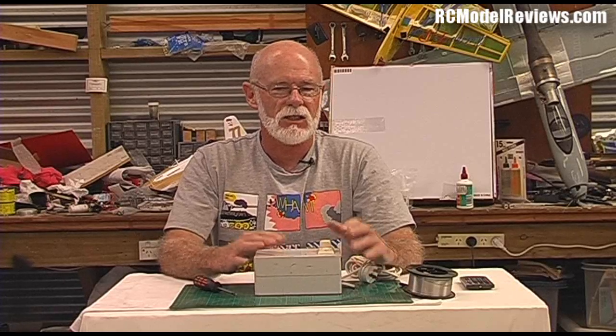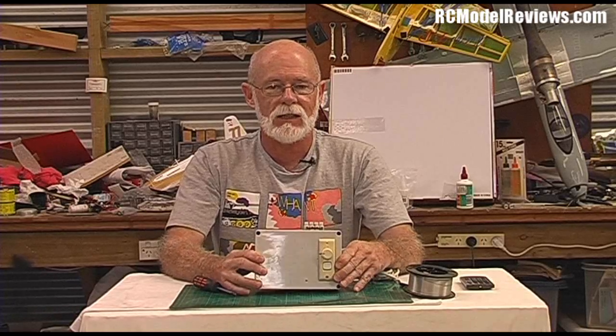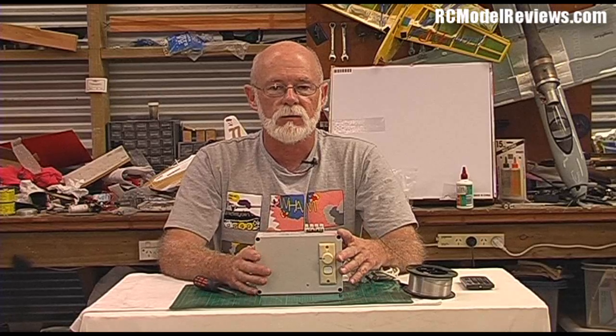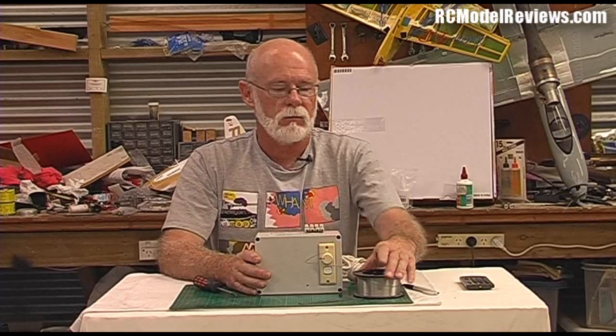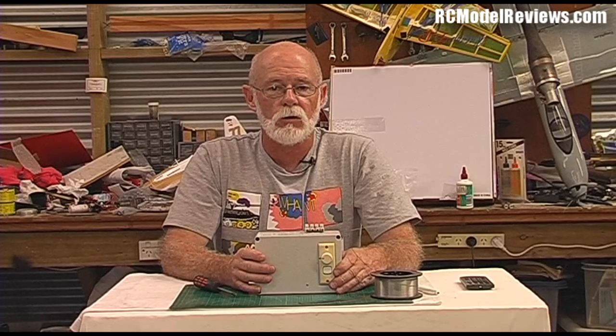Tension it up with bungees on the back of the frame and you're good to go. If people are keen I'll show how to make templates to cut foam core wings — make them from formica or even plywood; metal's not a good idea as it soaks the heat away from the wire tip. I did build a very big CNC foam cutter some years ago which was brilliant — I might build another and document the process as a DIY project. If you want more, put a comment below or go to rcmodelreviews.com.